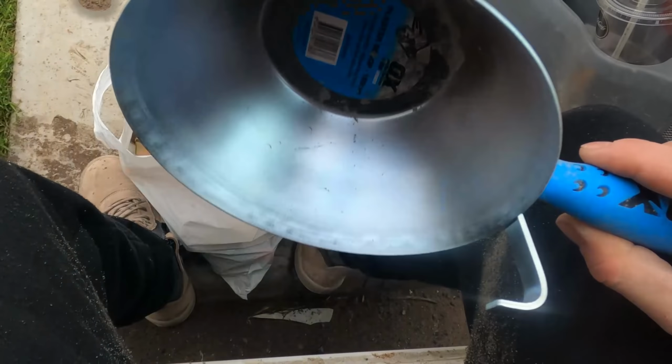These are the bomb. BT, shout out Simon, BT. These are the best. You must have these line blocks. The long-sided line block is the best. You chuck it on this edge with a line running out this way, you butt your brick straight hard up against the profile and against this longer edge. Keeps your brickwork nice and square at your angles. I've got a heap of these. I think I've got like six of these.